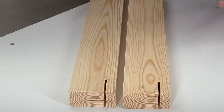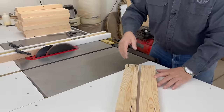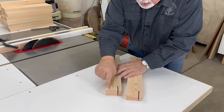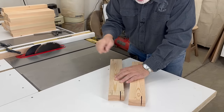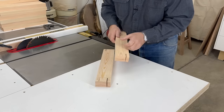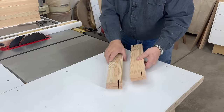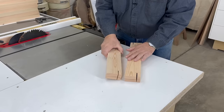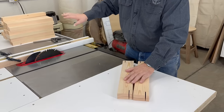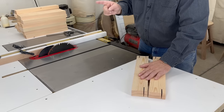We're going to go through and cut all of our boards just like this on this side, then reset our saw to make the cross cut. The stop block I put in there is a thinner stock block than three-quarters of an inch, so we don't have to move the stop block and won't lose our exact measurement. We'll cut all one side first — front, back, front, back — then reset and cut the other side. There are 20 pieces to our planter box, so this is a very repetitive cut. Pay attention, keep your mind on what you're doing, and be safe.